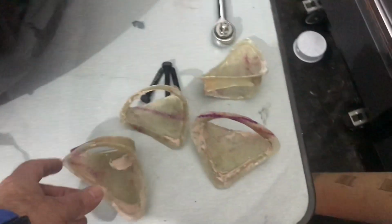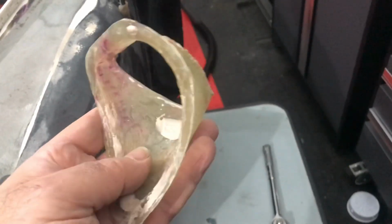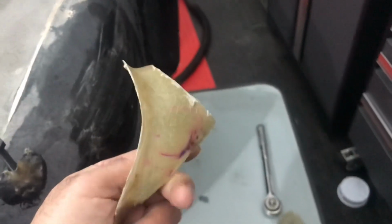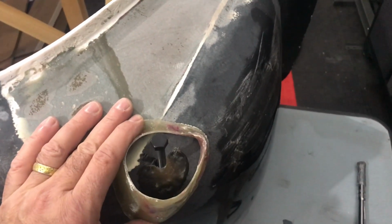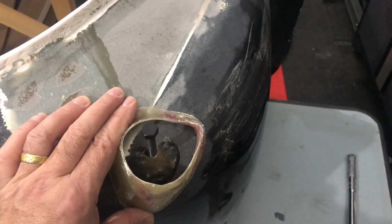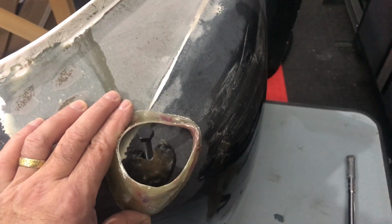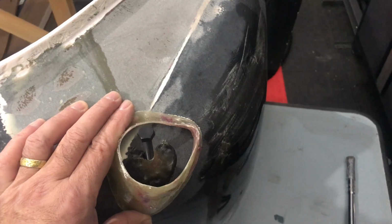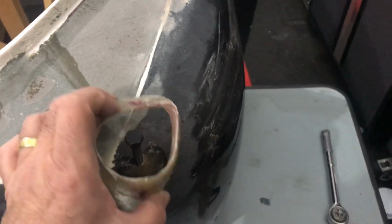And here are the molds. So I have a little Bondo on these. I'll sand these down, but I've cleaned these up. Sort of look like pork rinds, actually. Anyway, this is sort of the idea now at this point. So, you know, we use some hot glue and hot glue this in place, and then I'll fill that whole area up with fiberglass. You know, some fiberglass sheet, some chopped up fiberglass, etc. So we're getting to the home stage here.